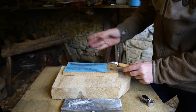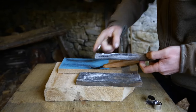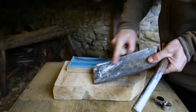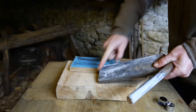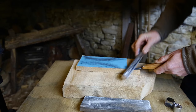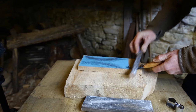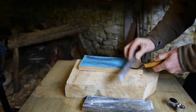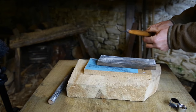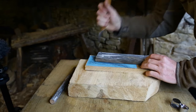Now we're ready to go on to polishing the bevel. This is Autosol metal polish, which you can buy from any car shop, B&Q, and Halfords — it's a very fine abrasive, equivalent to about 15,000 grit. I smear it on a piece of MDF and on this piece of broom handle, then polish the inside edge using a twisting motion, pushing diagonally across the blade, holding flat on the bevel. That's polishing away the very fine scratch pattern produced by the ceramic knife sharpener. Then onto the outside bevel on the flat — same action as before, just 10 or 15 strokes is plenty.